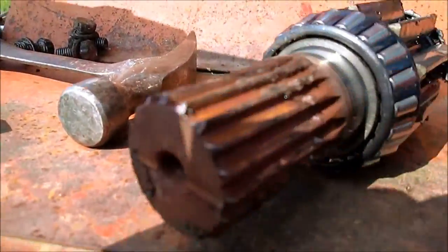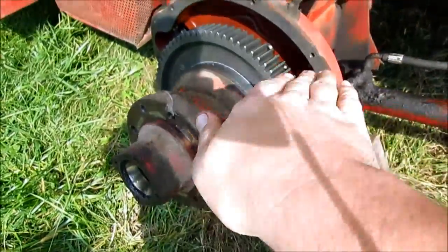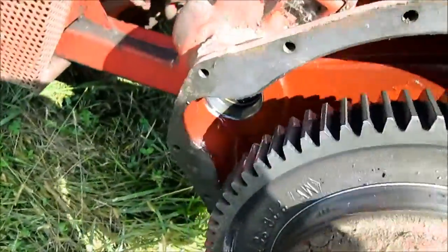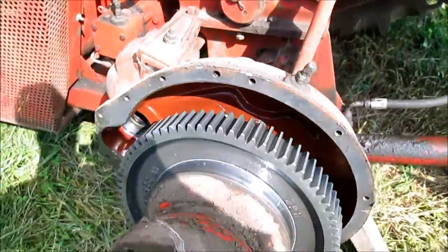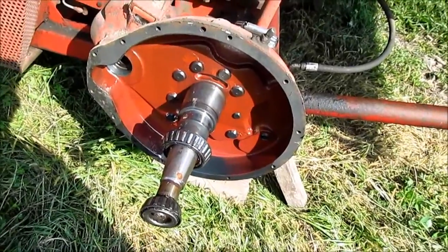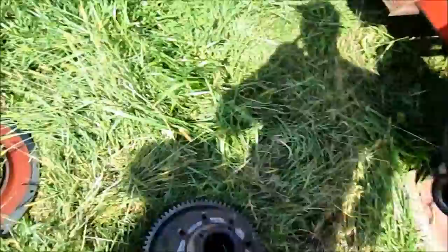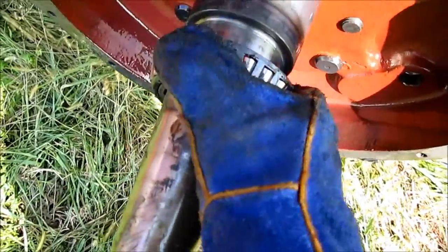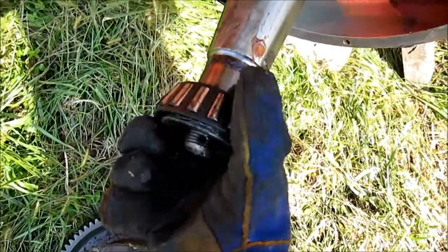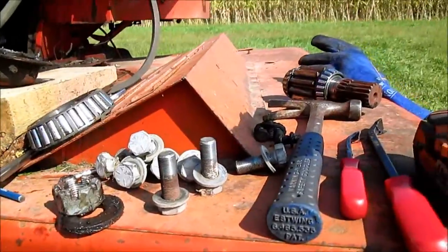See if I can see it here — I believe that is wear from the gear itself. This being just basically a wheel bearing assembly, probably has some play in it this way, so it probably doesn't mesh exactly perfect on the ring gear and pinion gear, and it's probably wearing this backside more. That's where we're getting those wear marks from. I'm actually going to rob the bearings off of this parts combine — they seem just a little bit tighter. Also, its face plate doesn't have that wear mark like the other one. And these just slide on and off.